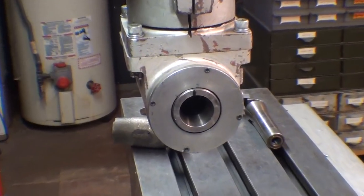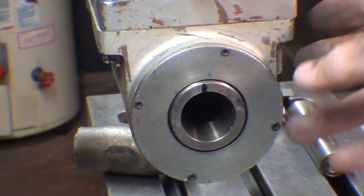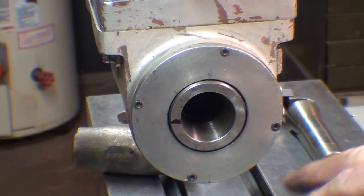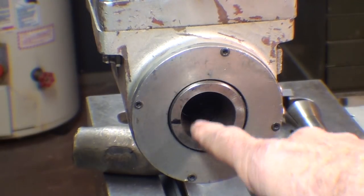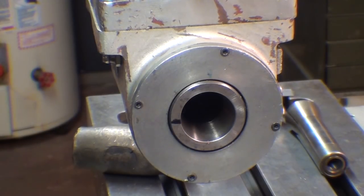It's mounted and ready to go, but I wanted to make this notation. There's a gear reduction in the bevel gears — I'm going to rotate the spindle on the motor end by exactly one revolution and watch the black mark. Okay, that's one revolution of the spindle, and you can see that the R8 taper here moved only three-quarters of a revolution. So speeds need to be adjusted accordingly, if necessary.